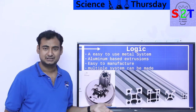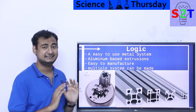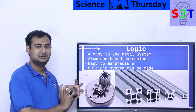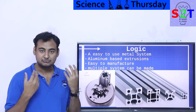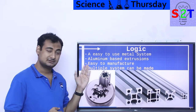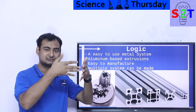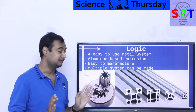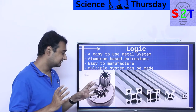Any small metal shop looks incredibly complex just to make a simple box — it's ludicrously convoluted for small things, even if it justifies itself for large projects. Aluminum was chosen because it's very easy to extrude: you take a die, push a hot aluminum billet through it, and you get a very long profile out of it. The profile can also be pulled from the other end, giving it much more structural rigidity. Many people have tried to create modular metal systems before — bricks are also modular — but for metal it never worked out because the manufacturing wasn't easy enough. With aluminum extrusion it's completely different: manufacturing is so easy that there are hundreds of intercompatible profiles.